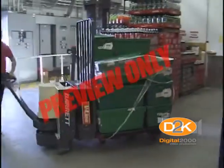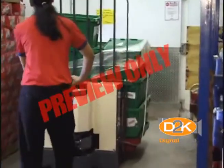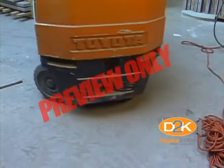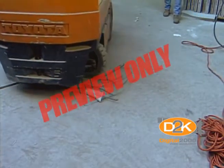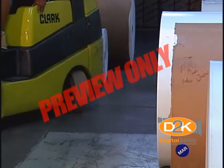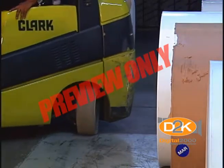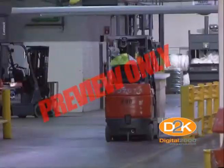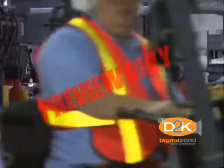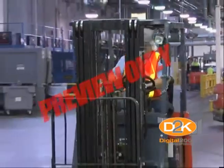Motorized hand trucks must enter elevators or other confined areas with load end forward. Running over loose objects on the roadway surface shall be avoided. While negotiating turns, speed shall be reduced to a safe level by means of turning the hand steering wheel in a smooth, sweeping motion. Except when maneuvering at a very slow speed, the hand steering wheel shall be turned at a moderate, even rate.